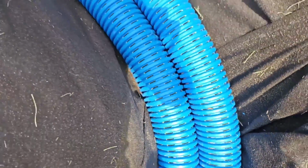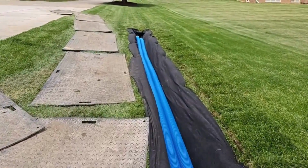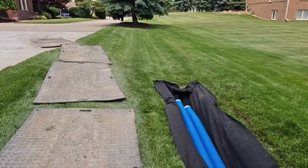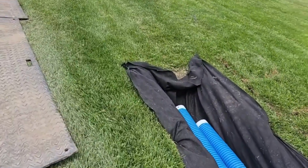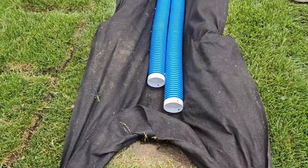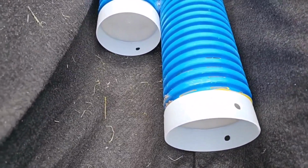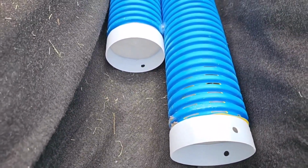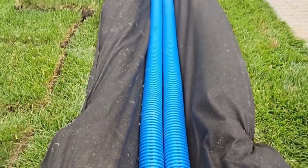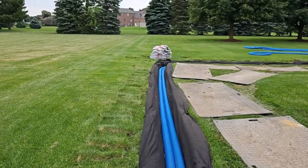When Home Depot has them on the shelf, and that's what homeowners are buying, now you have an obstruction in your drain system, and debris and garbage can get caught on it. So always use an external coupler. Those internal couplers were just for farm ag. That was it, for doing agricultural drainage. Now always cap the end of your pipe so that it doesn't fill with stone. And if you're going to use an all virgin pipe with no recycled materials, go with an all virgin end cap that's not made of recycled materials, like those right there.